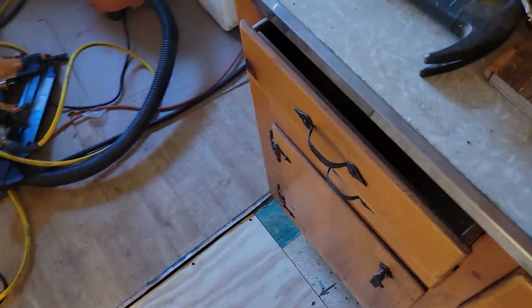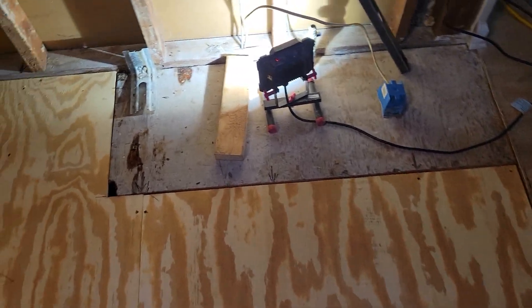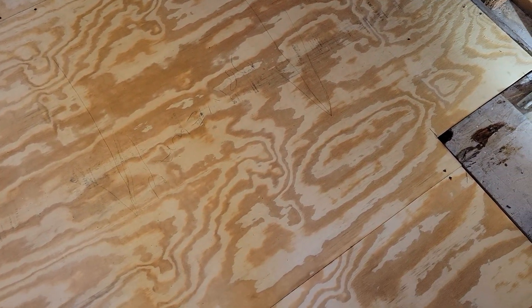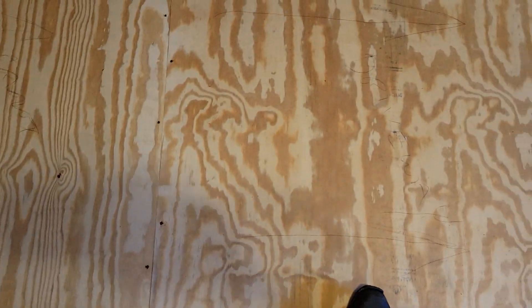You really can't stand there. Lucky I landed dead on the beam here, so I can nail from both sides on this one. It's gonna take another piece — a sister to the joist downstairs — so that I have the double beam to nail to.